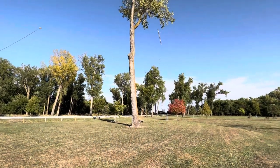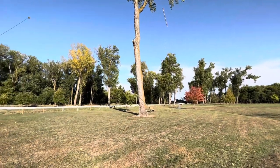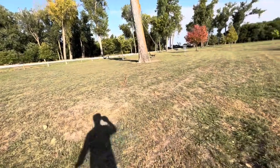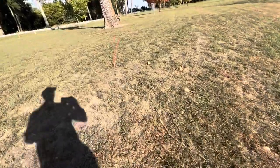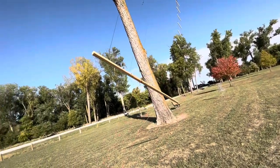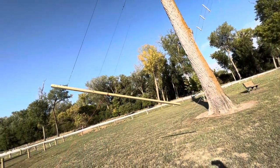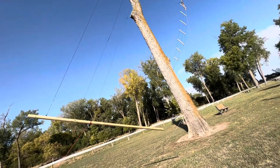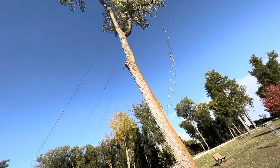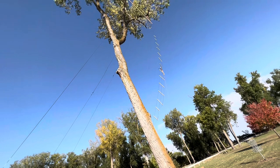I had to go into wide mode here because this antenna is pretty big. This is the VE7CA antenna. You'll see an orange string which goes up to this two-by-two. That's a tri-band, mostly vertical Yagi — tri-band. There's a fan dipole on one side and reflectors on the other side. The total length of this thing is 35 feet.